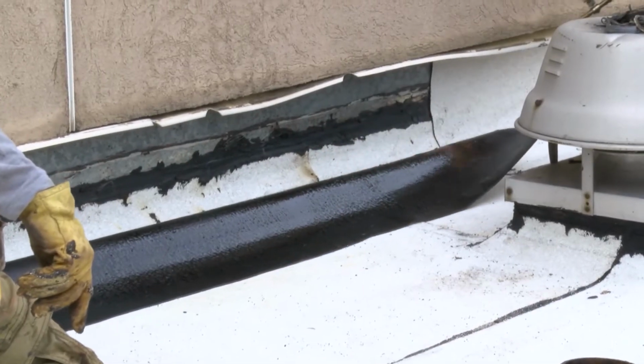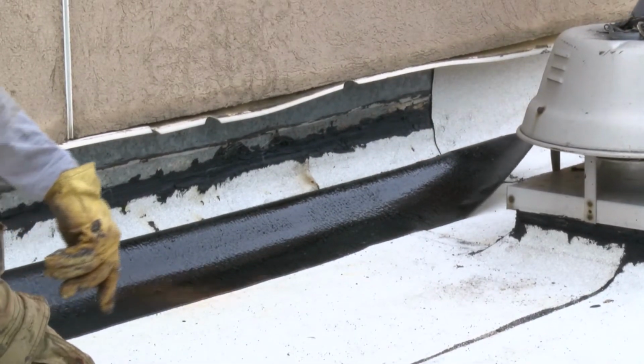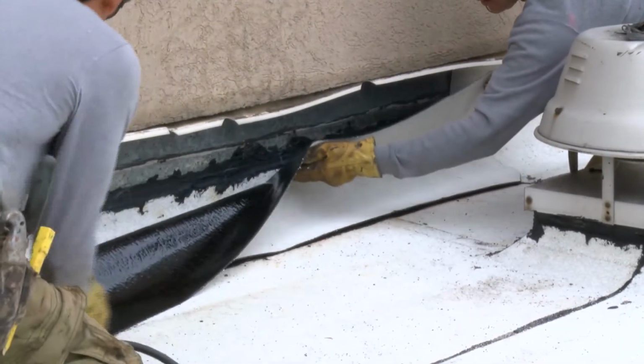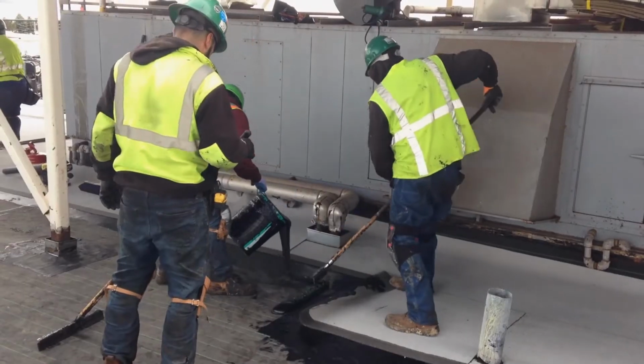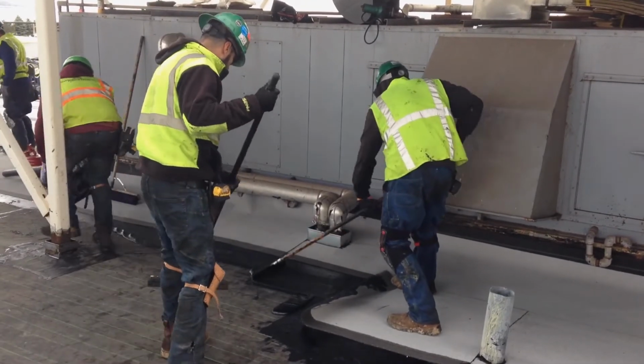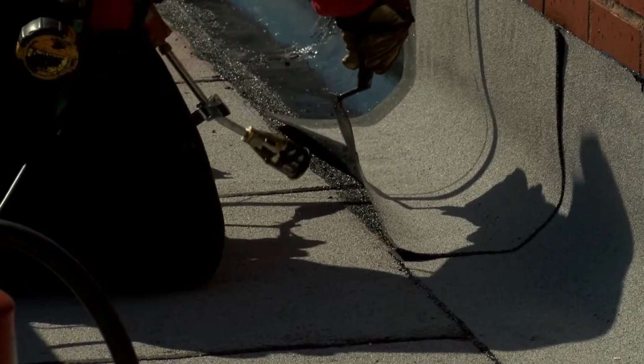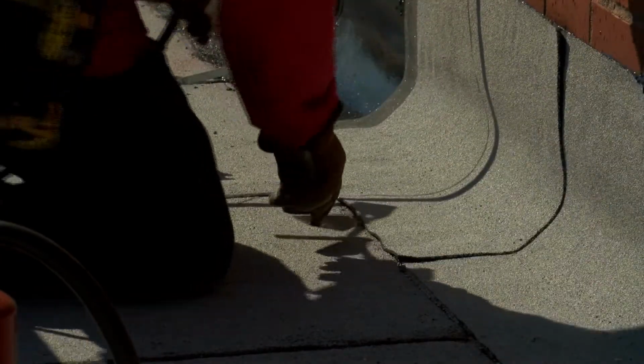For CERTA compliance and flashing installations, there are 4 approved methods of installation: torch and flop using indirect torching of material, use of cold adhesives to install material, hot mopping of material, and direct torching of material using low output detail torch of 105,000 BTU or less.